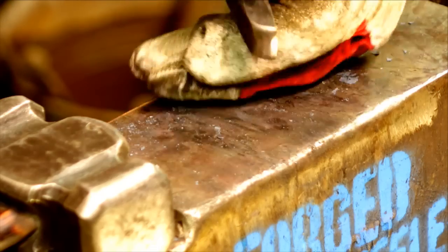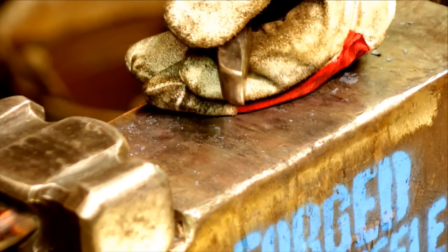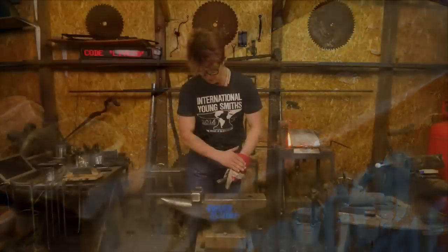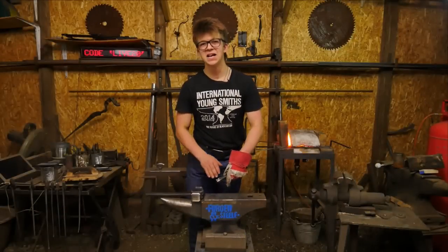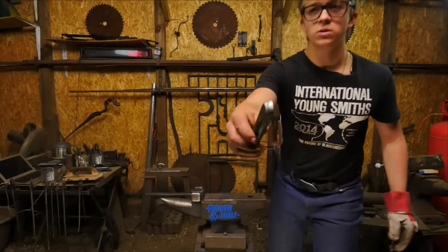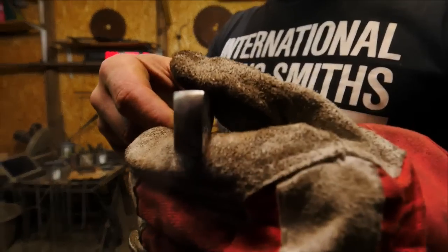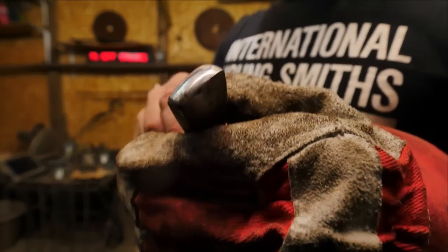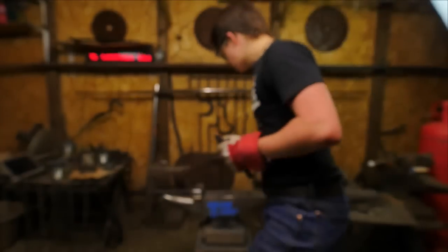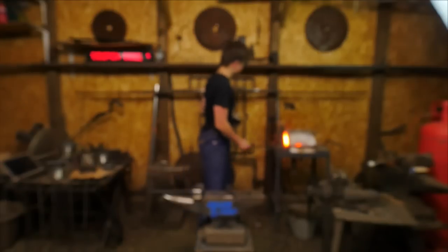And then of course we go down to this, which is a certain style of form fuller, which is almost like a ball fuller cut in half, cut down the middle. And it's a very exciting tool to use. You'll see right here the kind of general shape of it. And this is like a fuller slash butcher. It's a fuller butcher combo. And it's wonderful for dividing materials in somewhat aesthetic ways.